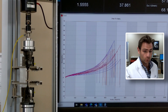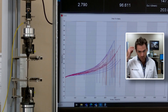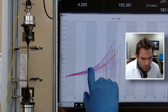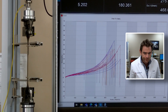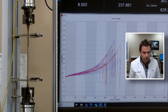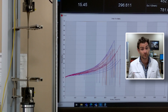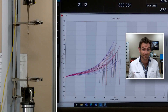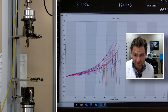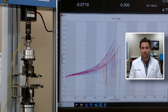Here we go, the stretch is happening. Where is it? Right here — high, in the upper 25% with a fairly steep arc. It's slowing down, that's good. It's met 400, so it's meeting that standard. It's still going — that was a strong glove. So it made it into the 500s — that's the fourth one that's made it into the 500s. That's 508.48% elongation. Tensile strength of 46.